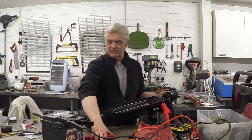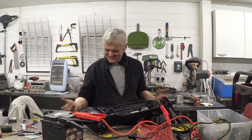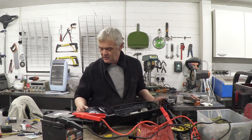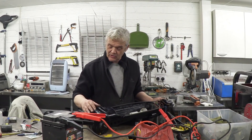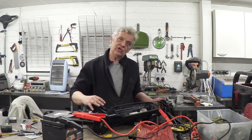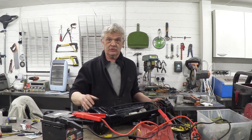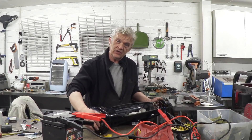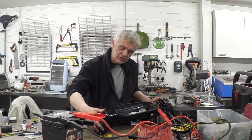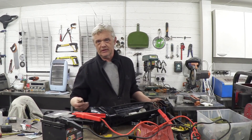That's it back together, and if we connect it to our battery — it is working. I can feel airflow coming out here and I can feel it coming out there, so it's working on 12 volts DC, connected straight to the motor. We've isolated the in and out so that the gas can't go into the motor and now just comes through that passage we made by laying the rubber. If you're a bit worried about it, you can drill a couple of holes and squeeze some silicone in there, though you have to be careful around the part that supports the other end of the motor.